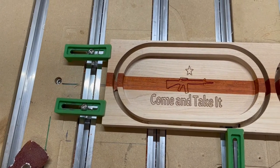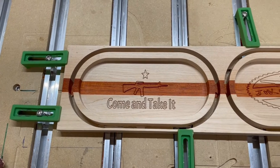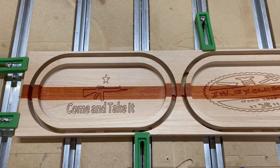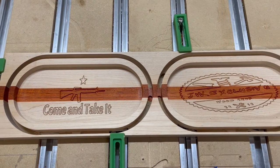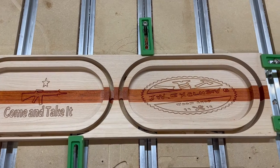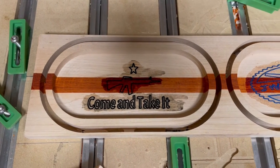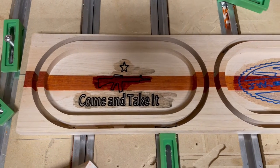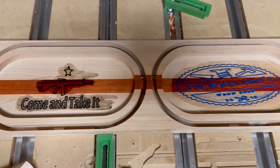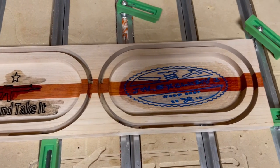I apparently lost almost half my video of the planing and the CNC cutting. Just a reminder: we used that 3/4-inch bowl bit, the quarter-inch down-cut bit to cut the perimeter, and that 30-degree V-bit. With the 30-degree V-bit, whatever depth you stop that bowl bit at — for this it would have been 0.5 inches — when you start your path for that V-cutting, it has to start at a depth of 0.50, then you set your depth. Take your time on it. Sometimes it's good to have a practice piece, sometimes you nail it on the first try — luckily I got it on the first try.